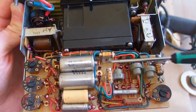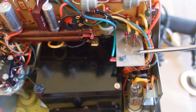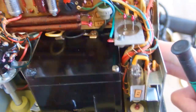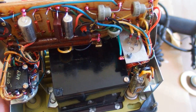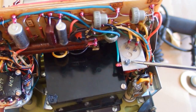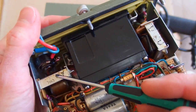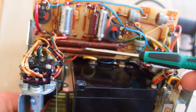I can only see three transistors in it — one, two, and three. But in the early 1960s, transistors were something very rare, expensive, and super high-tech. There is a stabilization vacuum tube, and because the Geiger counter tube requires about 400 volts, there must be an inverter, probably using this power transistor and one of those transformers.